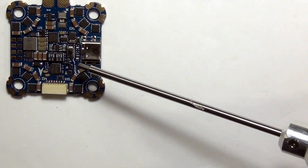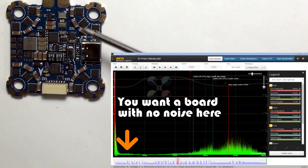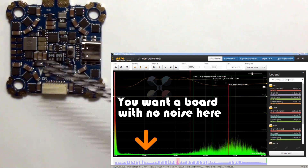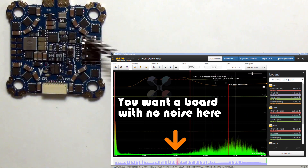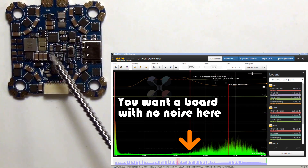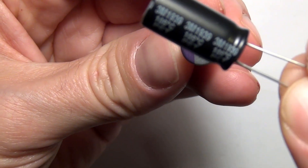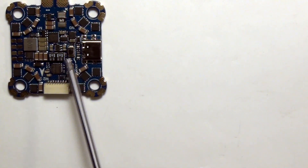What I really like about this board is the performance. For an all-in-one board, I see really good gyro noise results from it — no electrical noise. It's really ideal gyro performance, and that's a testament to the iFlight Bumblebee as well; the frame has to be good and the gyro and electronics in the board have to be good. With an all-in-one, that's a little trickier than normal. Other all-in-ones have electrical issues because of capacitance and feedback loops into the gyro. On the stock Bumblebee you're only getting a 220-microfarad 50-volt capacitor, and even so this board performs well noise-wise electrically.